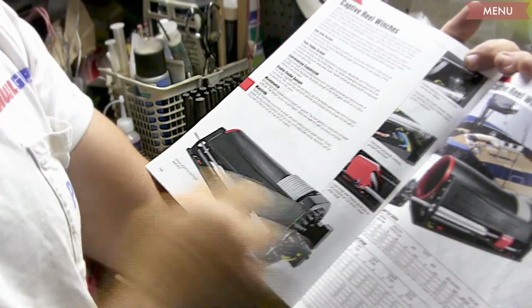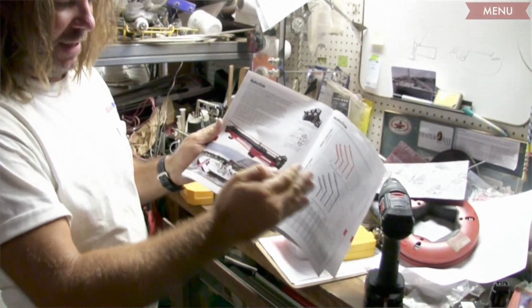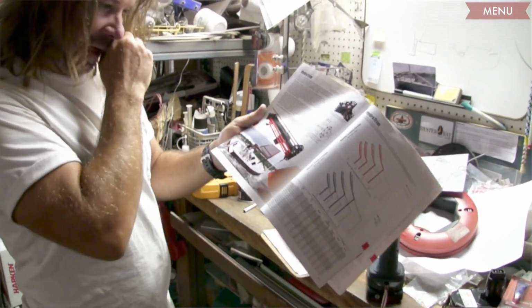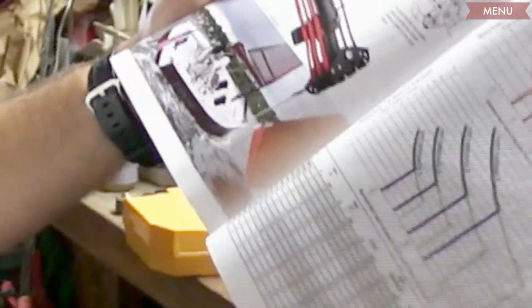It can be used for Genoas, travelers. This one winds the line up around and uses a ram. So as the ram extends, it's basically pulling the line in and letting it back out, and keeps it controlled. Wow. And they're used on boats like this, so that's why you see, like, where's all the running rigging? It's all so clean. Yeah. That's how you do that.